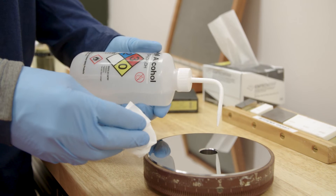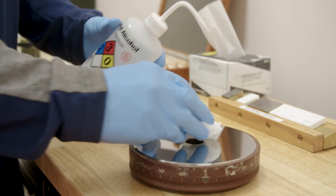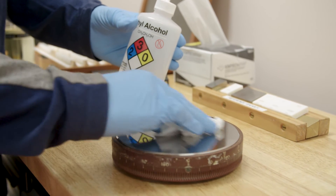So it's important that we clean the surfaces really well before trying to ring them together. That involves using ethanol to clean the surfaces and then a lint-free wipe, and you might also remove dust using compressed air to gently blow any dust particles off the surface before you ring them together.